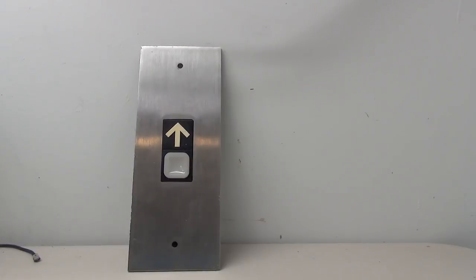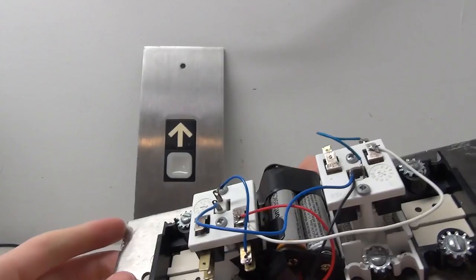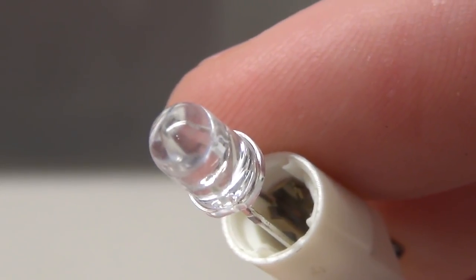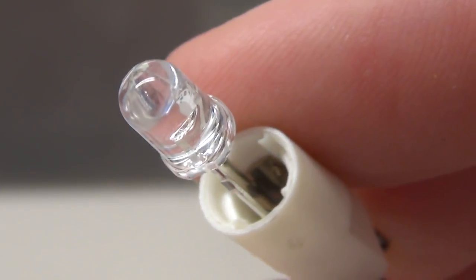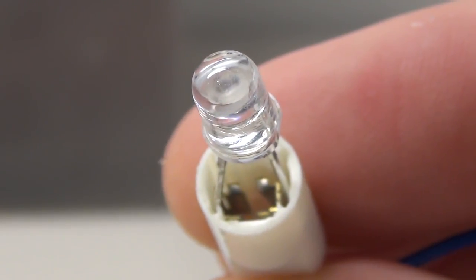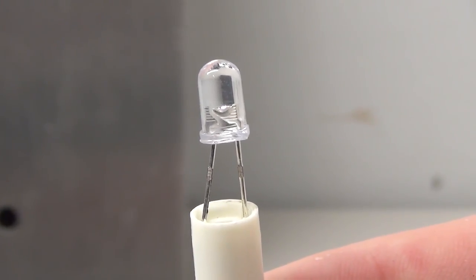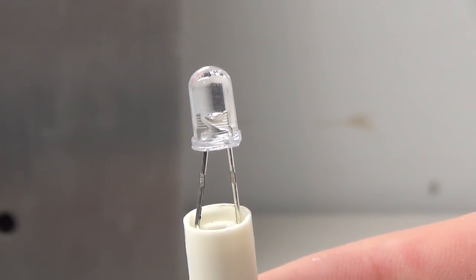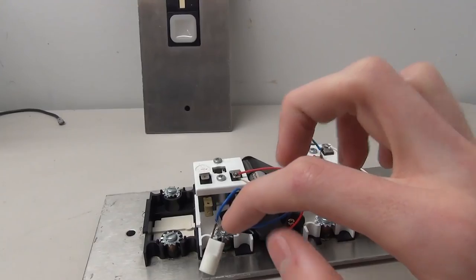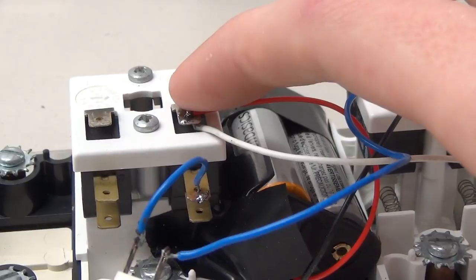But what if you have a lamp socket — what are you supposed to do then? If we take a look at this button that I've already wired, you see it lights up. What I'm going to do is simply pull out this lamp socket. All I've really done is taken the LED and shoved it in there onto the original metal pieces. You can see how they kind of bend in and allow me to press the pins of the LED into it. If you do have the lamp socket and plan on doing this, make sure you note what side is positive and negative — it's going to work the same way. You're going to solder the negative end of your LED to the negative end of your battery pack, the positive end to the switch, and solder the red wire from the battery to the top pin on the switch.